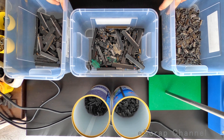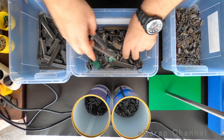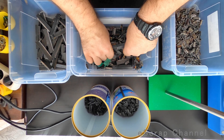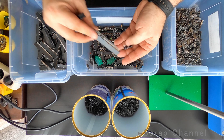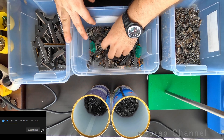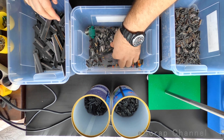Okay guys, so the fun part with the depopulation has ended. Now it's time to separate this stuff. So what we have — we have these really good Bulgarian ports from 16-bit computers. I usually put them aside since it's not easy to remove the pins from them, so that's good work for the long dark winter evenings. The funny thing is that they're also fully gold plated, which means that under the solder you also have gold mixed with the solder. So you first have to use some chemical method to dissolve the solder, get that gold, and after that recover the gold from the pins — the visible one from the plating. So these are the ports — they're thick and that's why I take them first.